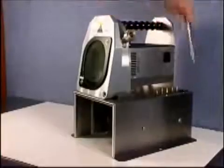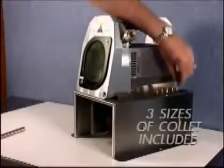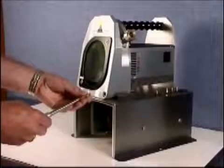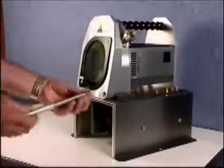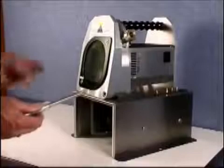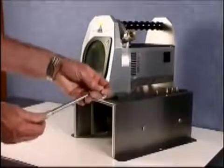There is a one-piece handle and three collets for the various sizes of tungsten. You select the collet for the size of tungsten you wish to grind and insert the tungsten into the collet, leaving approximately 25 to 30 millimeters stick out.